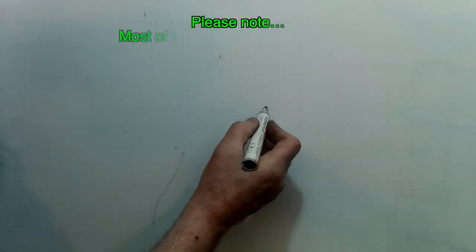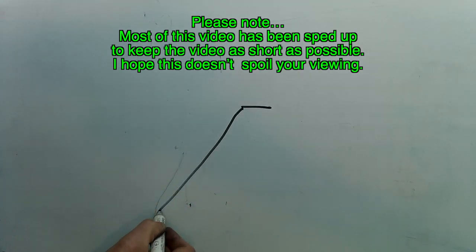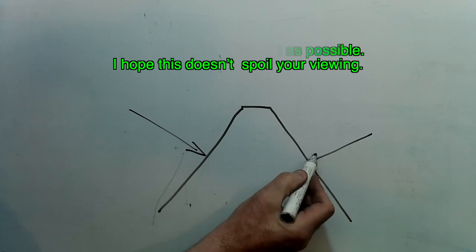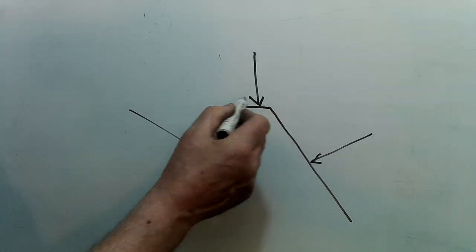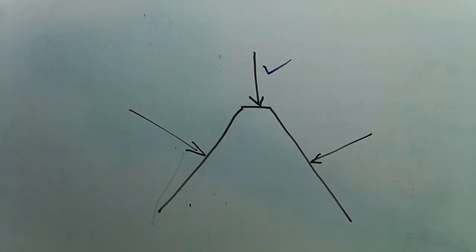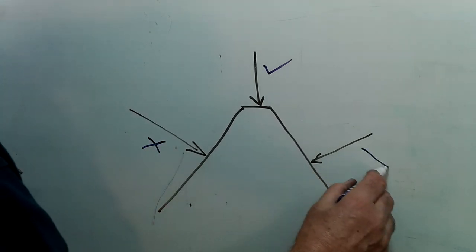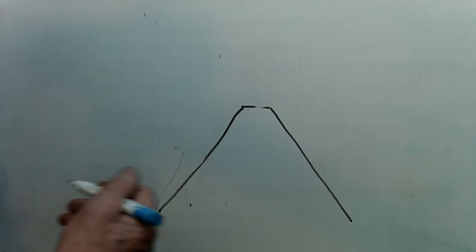This was my plan. Each side of all three slideways had an area of wear that required a modicum of reconstruction. In the previous video, I showed you that I had straightened up the tops of all three V-ways. I did this primarily to give me as many options as possible for whatever method I eventually settled with. On this sketch, you can see that the top face is done, and the side faces are in need of a little bit of tender loving care.